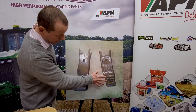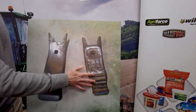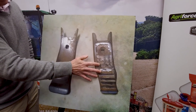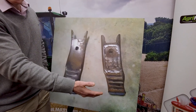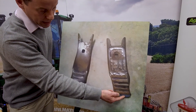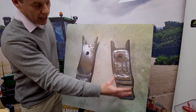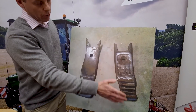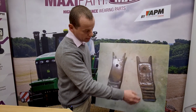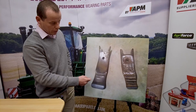This is exactly the same ground, as I say. You'll see that there's far less tungsten left but there's an awful lot more hard facing. So what this is — much harder conditions. The point where it's taken the most impact has reduced the tungsten down, the soil then shatters and goes over the point with less smearing over the top. So this is hard wearing ground, and this is softer, wetter ground.